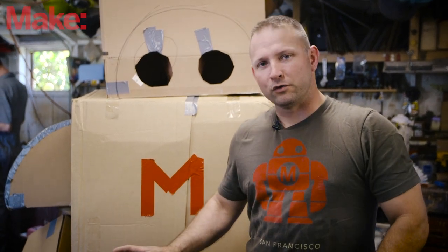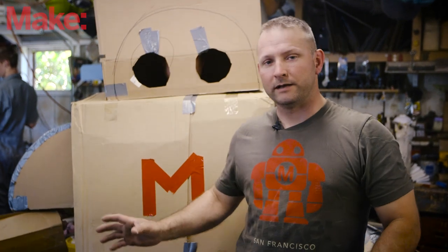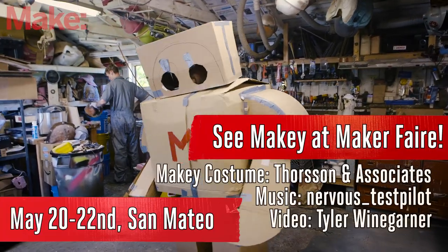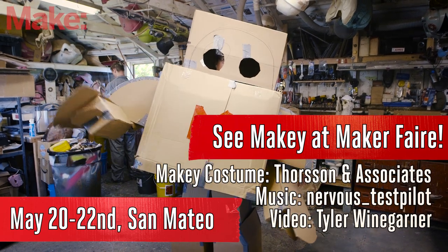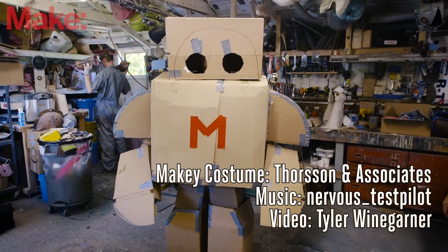We're calling this an effective proof of concept. The next thing that needs to happen is I'll start using this to get some ideas of the dimensions for the actual parts. We'll start cutting some things out of MDF, building some things out of foam, and then once we've got our initial shapes, the next step will be pulling molds, pulling parts out of those molds, grinding all the edges, and putting everything together. A quick and simple project done in no time at all.